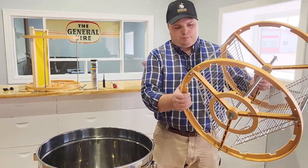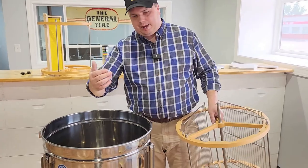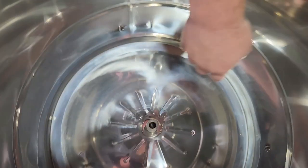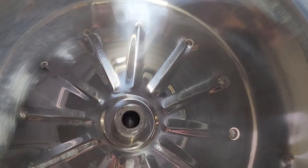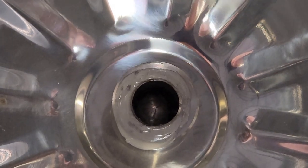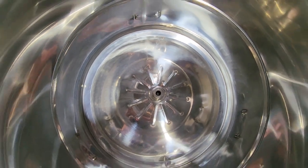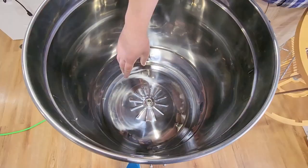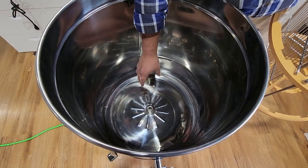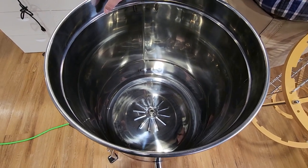This is how you disassemble for cleaning. I've just pulled the reel out. This is your bearing socket down in here — there's a large hardened stainless steel bearing ball in there. That is very, very important. If you're cleaning this machine, taking it apart, or maybe dumping it upside down to dump water out, be very careful not to lose that large stainless steel ball. It's critical — you have to have it in there for the machine to operate properly.